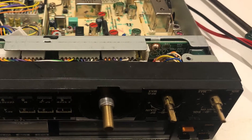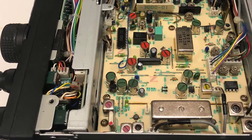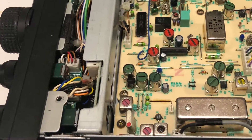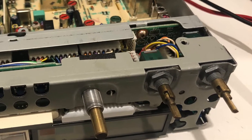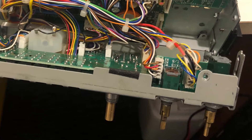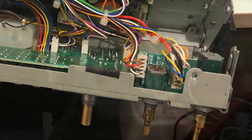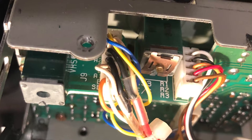What we're going to do is start pulling the radio down so that we can remove the pots and have a go at repairing them. It's a fairly fiddly job taking the covers off. We need to take the front panel off, hinge the front panel forwards, and the pots are mounted on two little boards just behind the front panel.